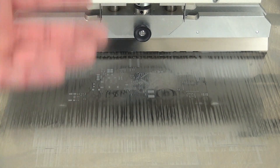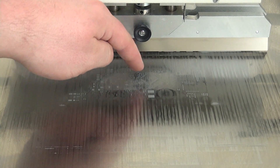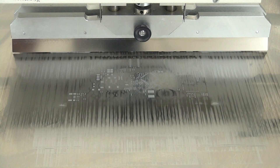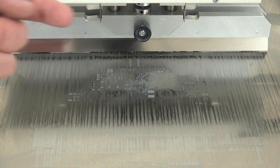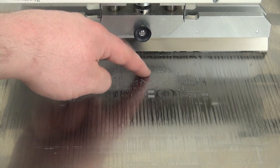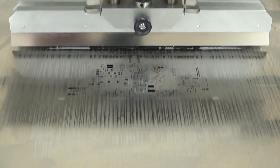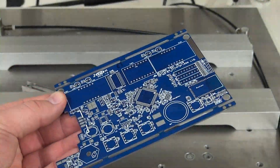Because we have that push-up of the PCB plate onto the stencil, what we need to do now is drop the stencil. What I've seen sometimes is the processor pins or pads here are very thin and very fine — on a couple of occasions they actually stick into the stencil. So a little trick: I just take my finger while I'm dropping it and rub it around in a little circle so I know it actually falls through. And then you have the stencil lifted and solder where you want it.